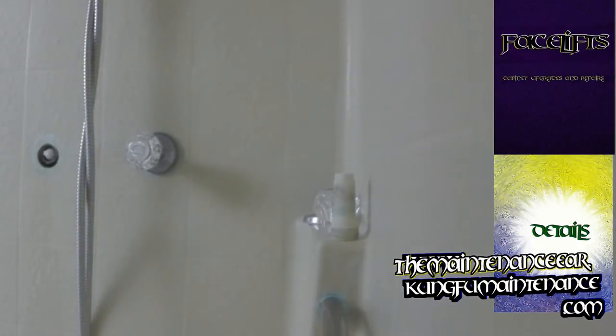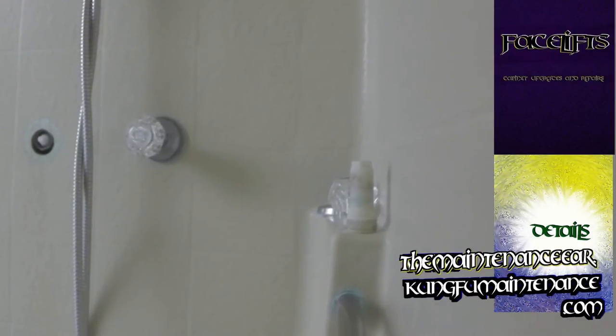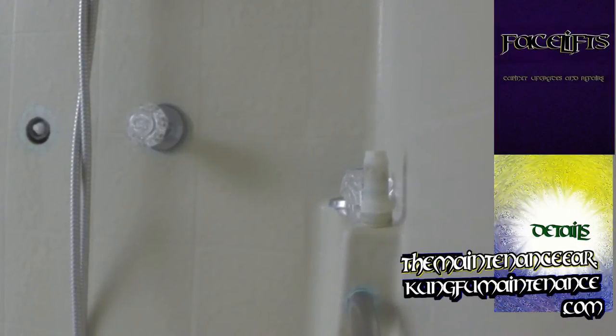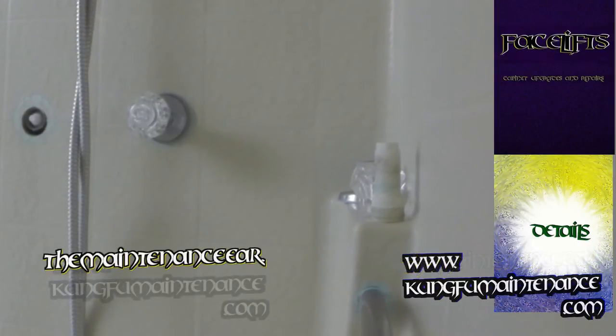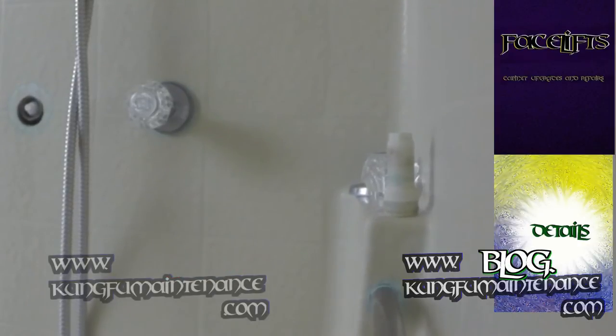So here comes some water. The reason I don't want any air in the lines is the air can act as what's called an air hammer or water hammer. It'll travel through the plumbing and right where the plumbing turns, it can smack up against the elbows and stress it out, which could possibly cause a leak or at least contribute to a leak developing.